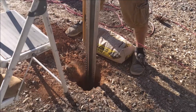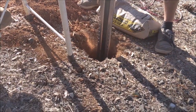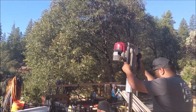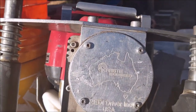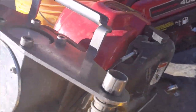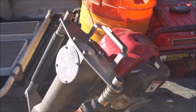You can see them holding the level on the post as it inches down with every drive of that gas-powered driver. The eight-foot posts go 24 inches in the ground total — the bottom 14 inches driven with the Christie gas-powered post driver. I'll put a link to this in the description; I'm sure you could rent them as well, and there are even mail-order rental places.